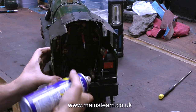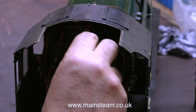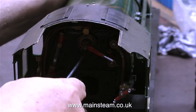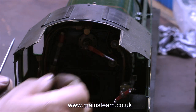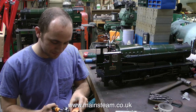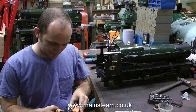After that, Simon gave him another locomotive to work on. This locomotive is a real pain — it needs a hydraulic boiler test, but the regulator leaks so badly that all the water runs out of the cylinders. In this clip I'm helping Phil to remove the phosphor bronze bolts that hold the regulator gland fitting to the back head. It took quite a while and was difficult to say the least. Here's Phil making a gasket with a hole punch.